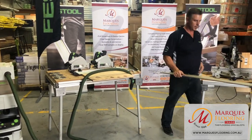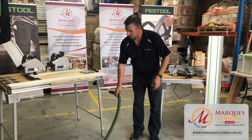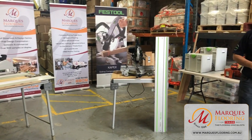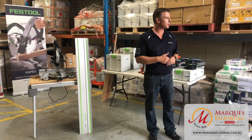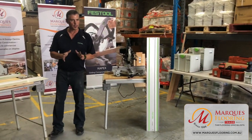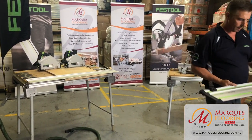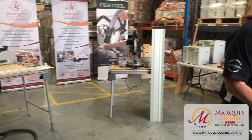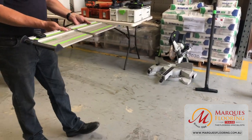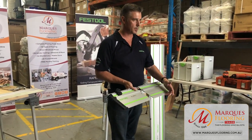Typical applications include sub-flooring, laying flooring, and cutting out damaged boards. You can set the depth on the tools with fine adjustment for accuracy. On the underside of the rail there are also clear splinter guards, and when you make your first cut, you're calibrating the blade to the splinter guard. Working off that edge as your measurement means everything's accurate and precise every single time.